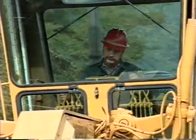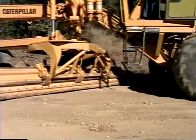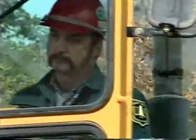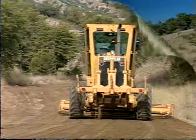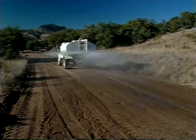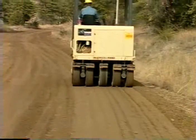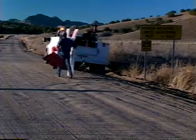With the mold board in a forward position, adjust the cutting edge to match the desired template and proceed spreading the material evenly across the road. Then, gradually raising the mold board, spread the surfacing material as evenly as possible to a uniform thickness. The actual number of passes needed will depend on the width of the road. Once you've smoothed the entire traveled way, add a small amount of water. Finish by compacting the road surface and shoulders with a roller, a water truck, or a grader-mounted roller. When the smoothing operation is complete, remove the traffic control devices and safety signs.